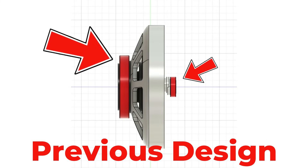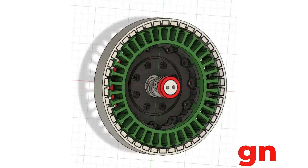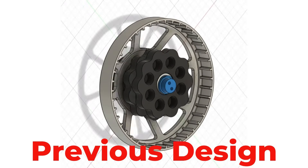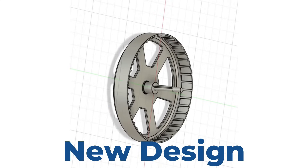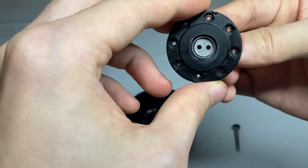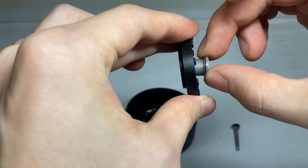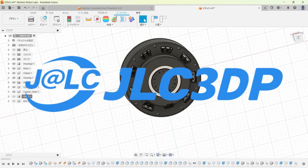The first cause is that the bearing intended to hold the rotational center was placed too far from the rotor and stator, meaning there's no guarantee the center is correctly aligned where the stator actually sits. So for version 2, I added a bearing inside the stator to maintain the rotational center at the most reliable position. The second cause is that the rotor itself was split into multiple parts to accommodate the cycloidal disc — the more contact surfaces you have, the more slight distortion and misalignment can build up. That's why this time I made the rotor completely from a single piece. The third cause is that the bearing clearance was too large. The JLC3DP service I used previously provides extremely high precision, which ironically increased the play and made center misalignment more likely. So for this design, I set both the shaft side and housing side to just a 0.05 mm gap and ordered the parts from JLC3DP, this video's sponsor.